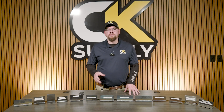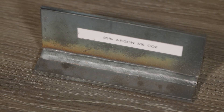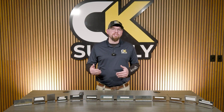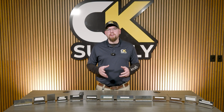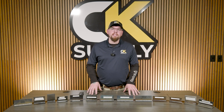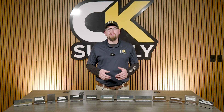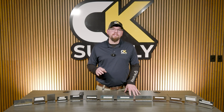Now let's look at the 95-5 argon CO2. This weld looks fairly uniform and consistent, pretty crowned up on the weld bead, and the toes of the weld appear cold. Now let's look inside — it is very noticeable that we did not get adequate fusion into the base metal. Argon being non-reactive serves mostly as a shielding gas and assists in arc stability but does not contribute to heat input. With a very low level of CO2, the reaction in the welding arc almost decreases the heat input versus that 75-25 mix. This might immediately shy you away from this gas, but if you do strictly thinner materials, a lower reacting gas might be useful for controlling heat input and decreasing possible burn-throughs. Or if you mainly use spray transfer, this gas will give you good arc characteristics and the atmosphere to achieve that higher transfer mode.